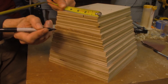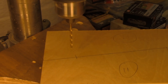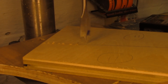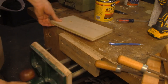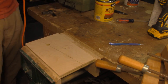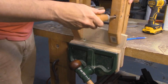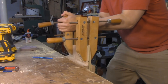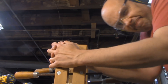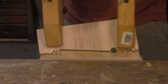I have them all stacked together and you can see them getting smaller. I'm making a diagonal line here and that's where I'm going to break all of these pieces. It turns out plywood is actually very difficult to break — specifically because it's engineered to be difficult to break — so I had to come up with a complicated setup where I weaken it with the drill, do a pilot hole, and then run my jigsaw through it. Trying to break this stuff I actually tore my vice off my bench at one point and had to remount it. The best thing to do is put screw clamps on and then jerk them back and forth, pulling as hard as I can. Even with that cut and those screw holes it's still very difficult to break, but it eventually breaks in this very splintery, ragged way — which is exactly what I'm looking for.